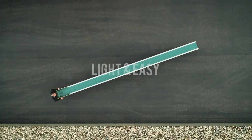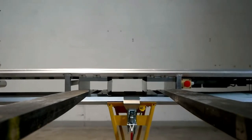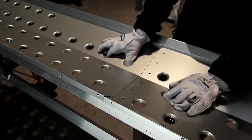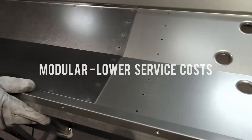The robust conveyors are designed in lightweight aluminum — one man can easily move an eight-meter conveyor. Soar Auto belt conveyors have an open construction with holes in the steel plates, which cools the belt and motor, as well as easing regular maintenance since the machinery cleans itself during operation. The plates are modular, so you only need to change a single one when worn.